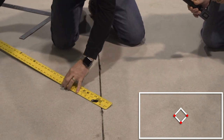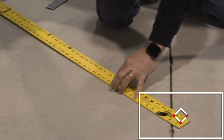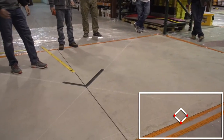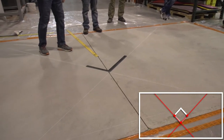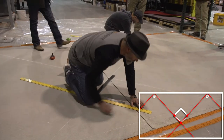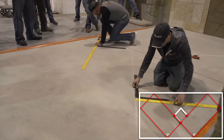If you go from intersection to intersection, I have exactly 24 inches right here, so it worked. From there, I'm going to chalk those two lines and that's all I need to do. I don't need a fourth point. I don't need any other points whatsoever. Quick, simple and efficient and straight to the point.